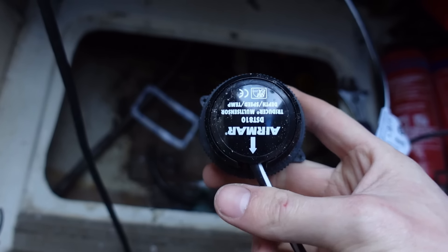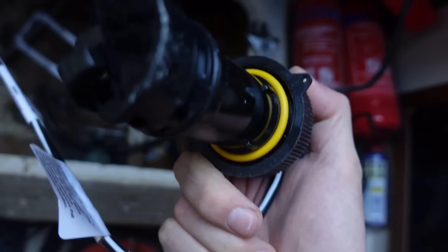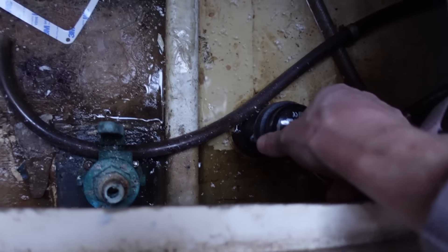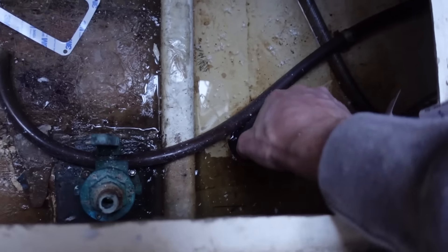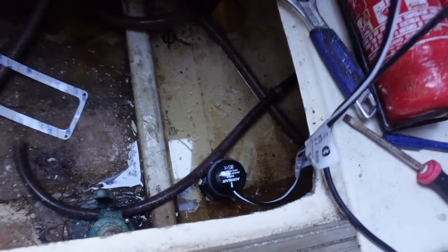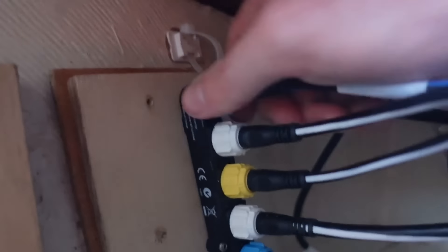This DST810 is the smart one that has an app you can connect to your phone. It's got a little arrow on top showing which direction to place it because that's where the wheel spins. Make sure you check the O-rings are there and clean. All we've got to do is put it down that hole. Make sure that arrow's pointing straight and thread it up the rest of the way. That wire will get chased up next to this hose — which is for the bilge pump — and run up and out the back of the boat.